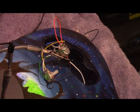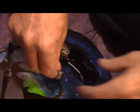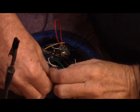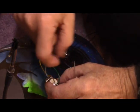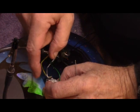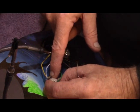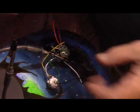The more ohms, the more electricity it blocks. This is a variable resistor. The signal from the pickup comes to the center pole called the wiper, which moves when you turn the knob. Inside there's a disc with a strip of carbon — that carbon is the resistor. The further the wiper goes along that strip, the more resistance there is. Turn it all the way to the end and you have no resistance at all and the signal passes through; turn it up and it blocks the signal.